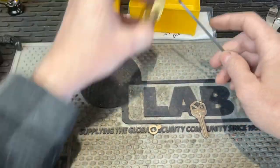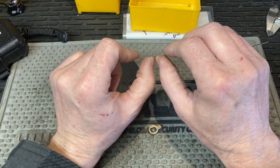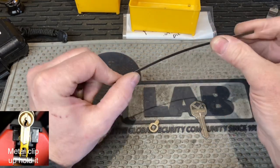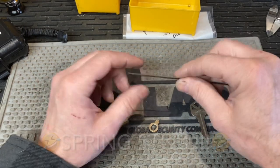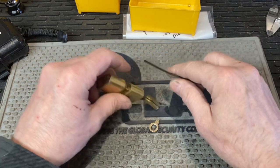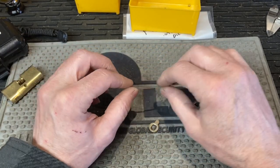Let me mention this — if you don't have that special kit or you can't piece it together, you can get some windshield wiper blade steel, or any of the flat spring steel. I had a lever tension spring steel assortment, and you can actually bend that and make yourself your own personal holder. Just don't do too tight of a bend or it'll break because it is kind of hardened — you can only bend them once or twice and they're done.